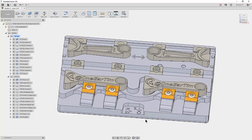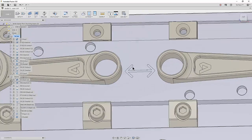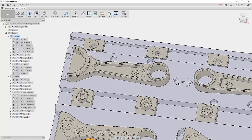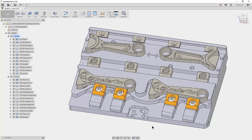I've made a lot of high-production fixtures that might get handed off to three different shifts. The more you write down, the better. I probably could have engraved 'push stock this direction,' because I machined two little stops for the stock. There were times when I didn't know the people running the machines, and I would engrave instructions like 'push stock against stops in these directions.' Also, for the people on the line: what kind of notes do you leave your operators? We may be working on a product — Fusion Production — for helping capture documentation on the shop floor.